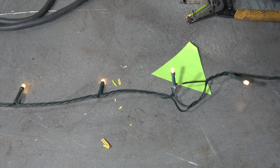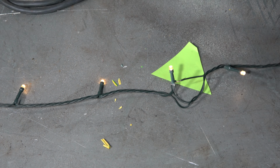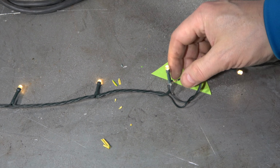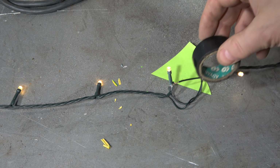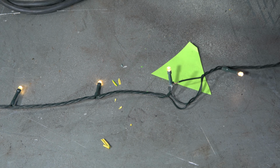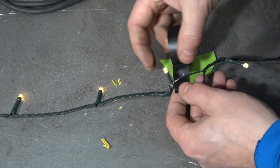Okay, and now when we are doing this in a professional way, we need black electric tape, because this cable is black, or actually it is dark green, sorry, but this black is almost the same. And now I have to repair this cable in the same way as this one. I do so that firstly I carefully install my tape in here, and then I compress this in this way. Good. This is like the starting point, and now my purpose is to protect this cable.